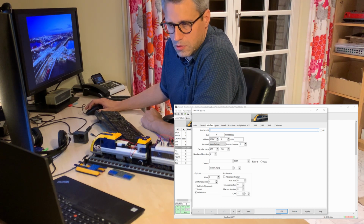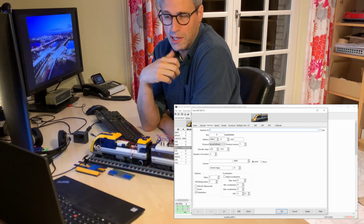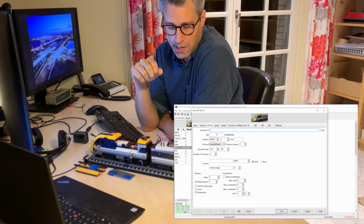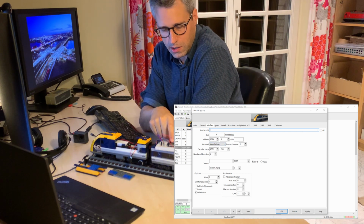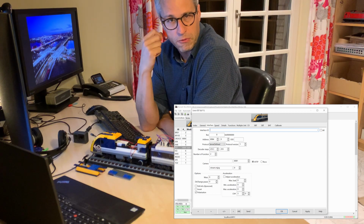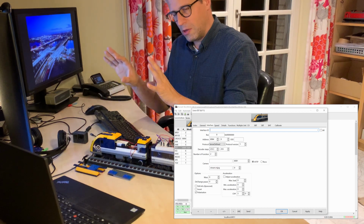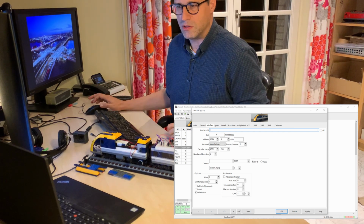It's important that you put in the ID of the MattzoTrainController here. It works like for the other controllers. The MattzoTrainController is generating a random ID and storing it in the microchip when it boots the first time. And exactly that ID, which you can see when you look at the MQTT messages, must be entered here into the address field.